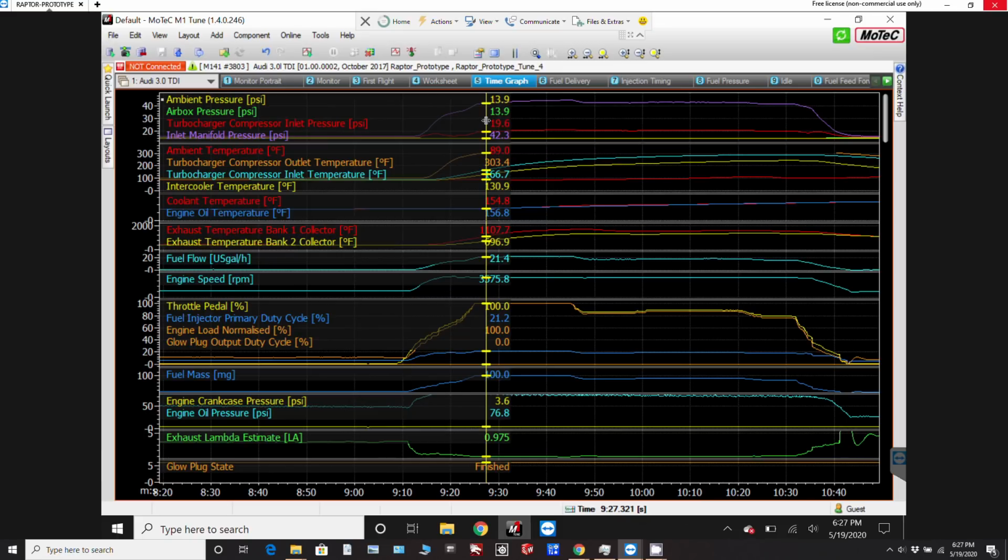So that small little air filter that I have on the air intake isn't really causing any sort of problem to be worried about. And you can see as I kept the throttle at 100%, the maximum boost I got to here was 44.8, something like that, was the maximum PSI coming out of the second turbo, and the first turbo was 20.8.